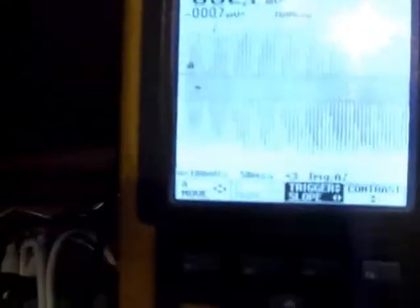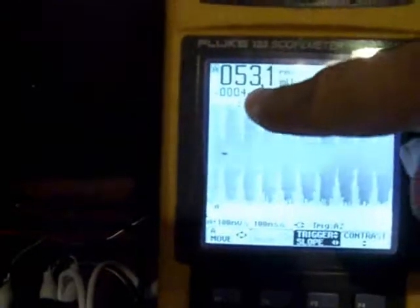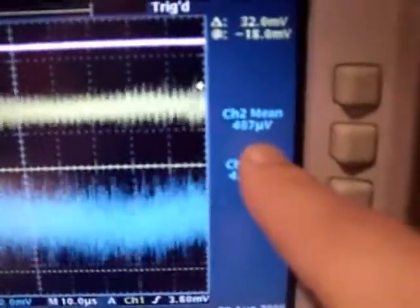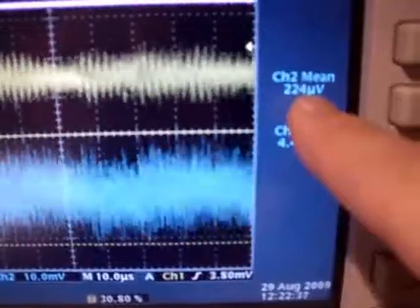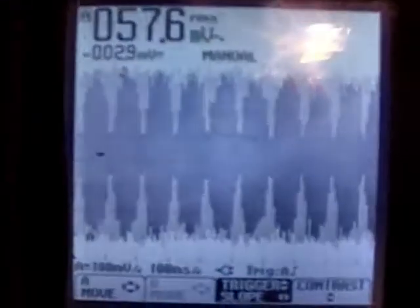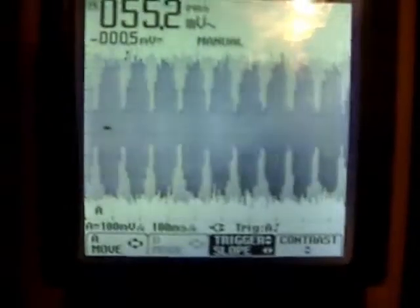For anybody who believes the oscillation is all about the timer — it's not. This doesn't mean the timer can't cause oscillations, but it proves the MOSFET is also able to oscillate by itself. There's no power going to the timer circuit right now; it's disconnected from any power supply and it's oscillating very nicely. It's averaging more negative voltage, but that doesn't mean it'll run cold — it just means more energy is coming out than going in. Whether it runs on positive or negative power depends on the load, and this load is running on positive power, so there should be heat. Full self-oscillation at the MOSFET — just ringing like a bell.